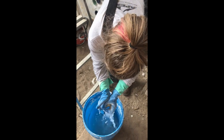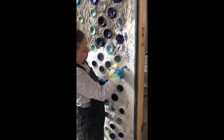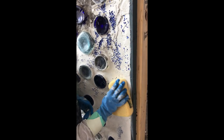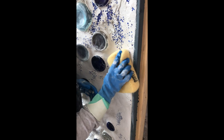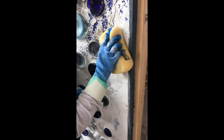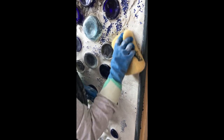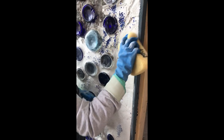After that, I come in with a wet wrung-out sponge. Since this is the edge where I finished yesterday, I'm doing little circles to get it floated in so the textures match. Once you start getting up to the beads, a lot of them will come out, but just keep working it around until you get the finish you like and get all the trowel lines out.